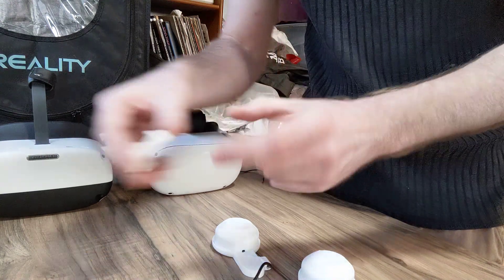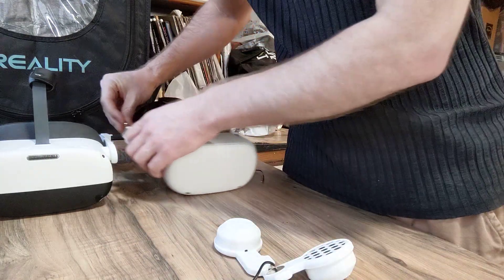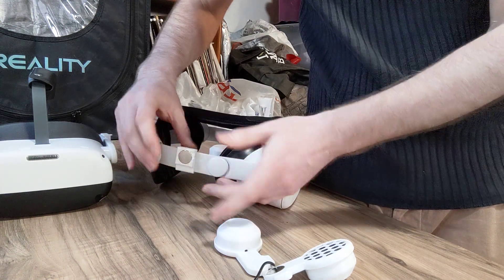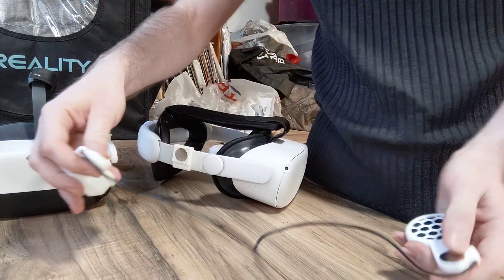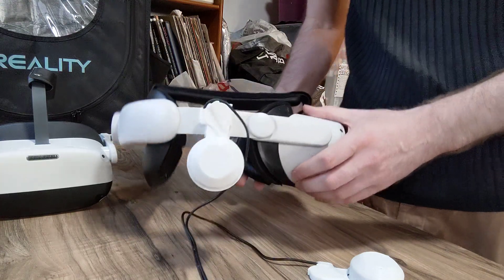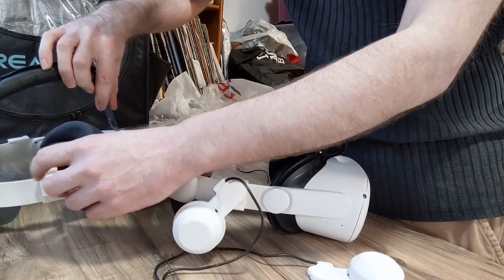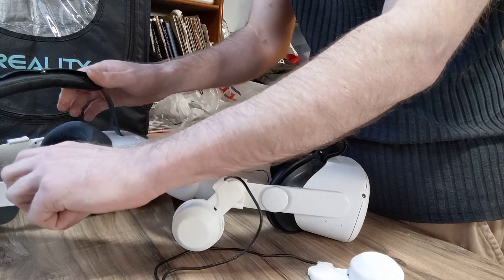If ear position matters I can change where the magnet is vertically. I went to a lot of effort to make sure everything fits perfectly — it's a nice tight fit, not too tight that it'll damage a head strap, and easy to clip on. The magnets you do glue in because they're super strong. I've also added a 45-degree stopper because on the Pico Neo3 Link you have a DisplayPort tether connection at the front, which means I can replace that bracket on the head strap and have the speakers at 45 degrees, which is fine for sim racing.